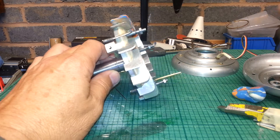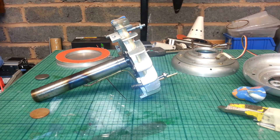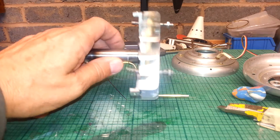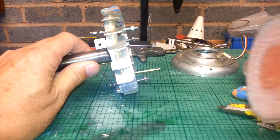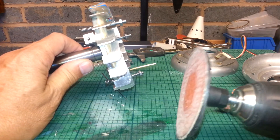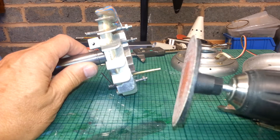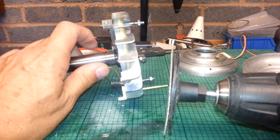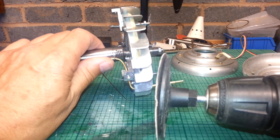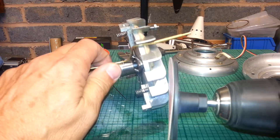So that's a quick tip — when you're doing this radius, you've more or less got to free-form it. It's better going in the same direction, clockwise direction. What you want to do is use a disc pad; if you've got something slow like this drill — obviously the bigger the pad it helps — and it helps with going in reverse, because then they're both turning against one another, so it does more sanding.